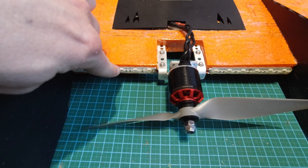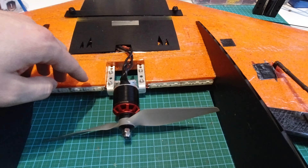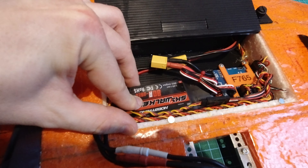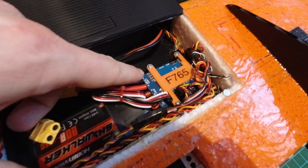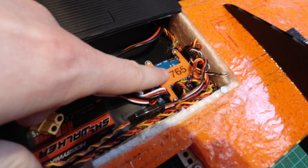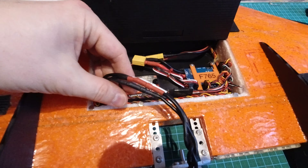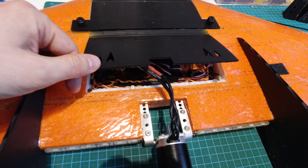I also used E6000 to glue my LEDs on the back, then it was basically making sure I got all the cables into the electronics bay and hooking everything up. The ESC is just velcroed in place and the flight controller is held in place using a 3D printed part I designed — you glue the base in and screw the top part on to hold it, meaning you can remove it without ripping any glue out. Everything is as far back as it will go because this is a fairly nose-heavy build so I needed to shift as much weight back as possible.